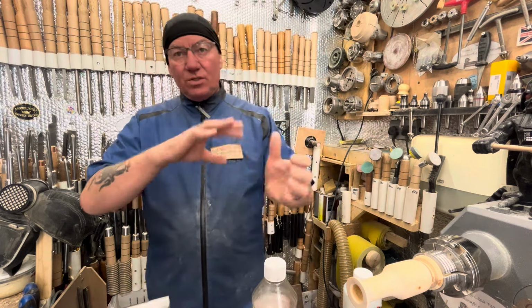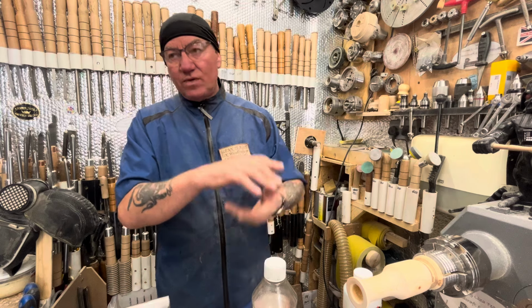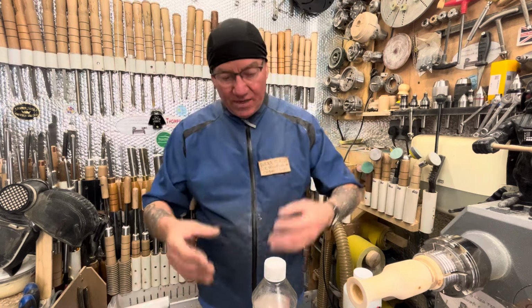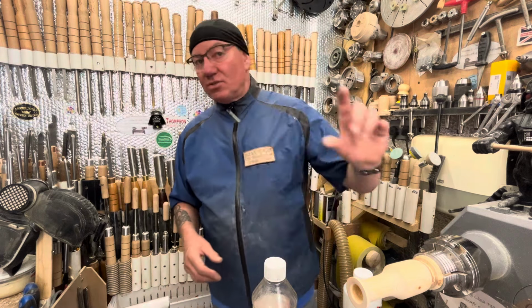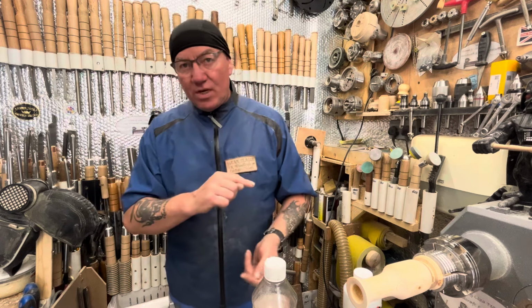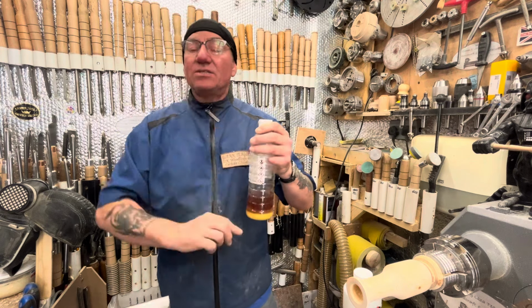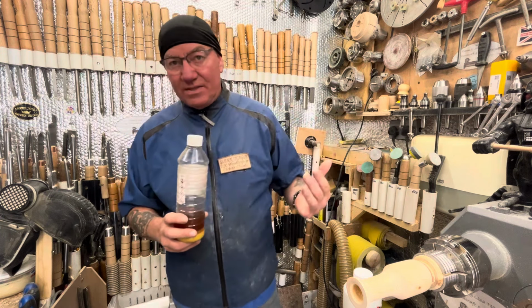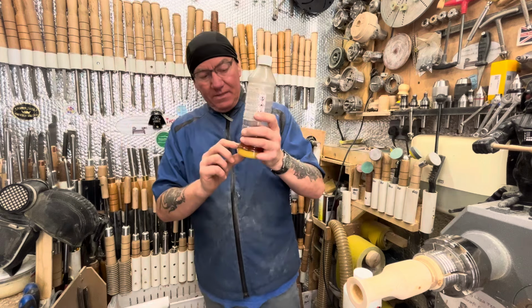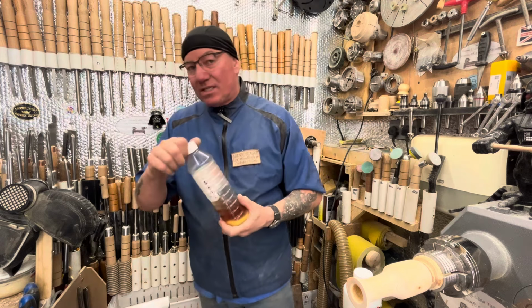The thing is, with a lot of it, when you do the shine juice and it's done in America, you use the Bullseye, which is already dissolved shellac. Shellac is flakes, and you have to dissolve it in alcohol. The trouble is, they don't tell you what percentage it's diluted. It's like here we get Rustins French polish. It's pure shellac, just shellac flakes dissolved in denatured alcohol, but it doesn't say what cut they've done, because it's obviously made in big vats. So if you put that in, and then you put denatured alcohol in, you're diluting it even more. So that's awkward to work out. I don't really know on that, because I don't have it.